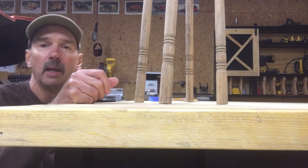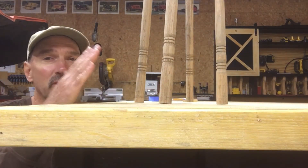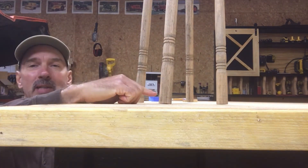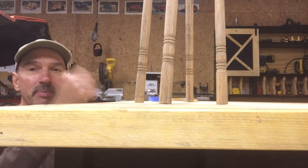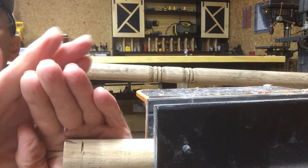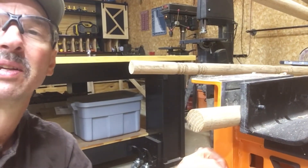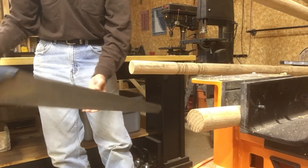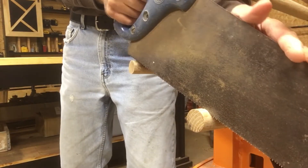Then what I do is I just take a hand saw. You can use a band saw too, as long as the blade doesn't drift on you — maybe a table saw, maybe. But I use a hand saw because that way I can just barely leave the line, and by the time I cut these off, it should sit nice and level. I'm leaving a pencil line and using a hand saw. To make this even more interesting, I'm not going to use a fine woodworking hand saw at all — just a very general construction hand saw. You can find these anyplace, and I'm going to use that to make this cut just to prove that you don't need expensive tools to do this.